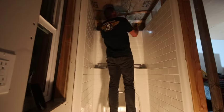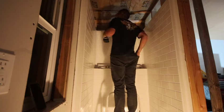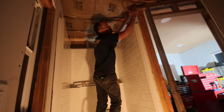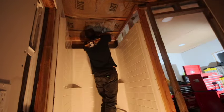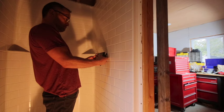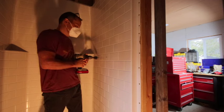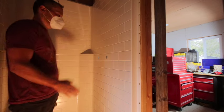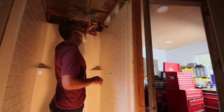I decided to use a drill bit and counter-sink a bunch of holes around the top perimeter. On the left side I only had a couple of two-by-fours I could sink into, but along the back end on the right side we had a two-by-four going along the whole way so I was able to put in a ton of holes and screws. I'm evening out the top with a two-by-four so I can put a level piece of drywall up there. Then it's time for the nerve-wracking part — actually drilling holes in the side of the wall for my shower valve. It's a little bigger than the shower valve handle so there's some leeway, but I think I did good.